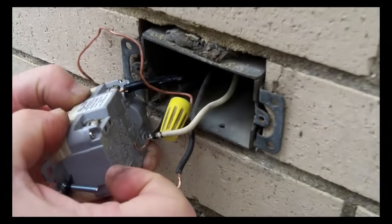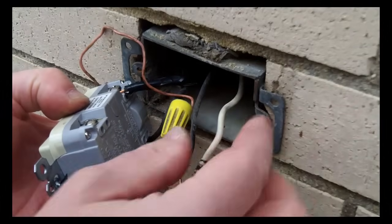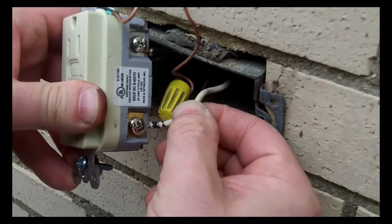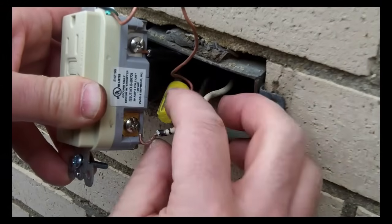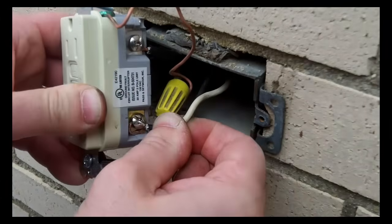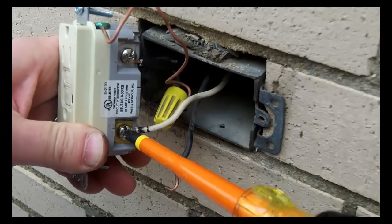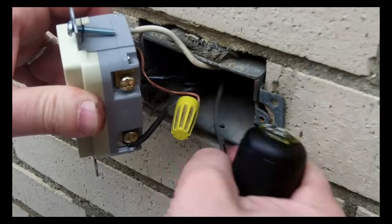Now what I want to do is hook up the neutral to the load. I have load wires taking electricity from the GFCI into the house to another outlet. So I'm going to put this neutral wire on this silver terminal, hooking it up such that when I tighten it down, it's going to spin the wire around the terminal and tighten it. This is the right way to do it — otherwise the wire could come off and you could have a really bad electrical situation in your box and somebody could get shocked. Do this for the neutral wire and then do it for the hot wire as well.